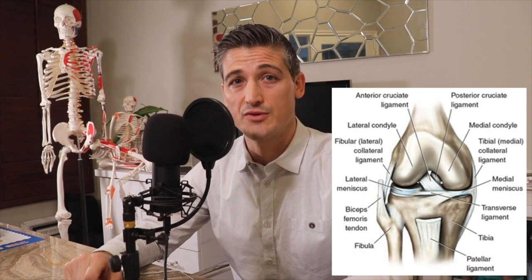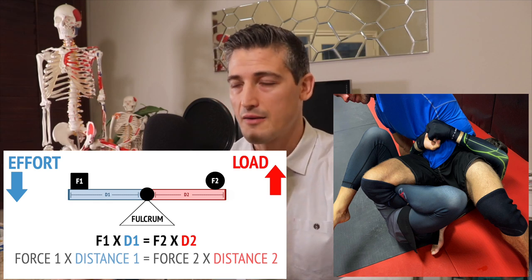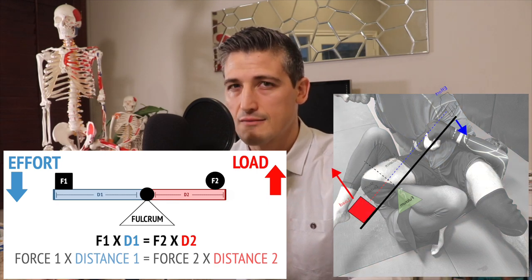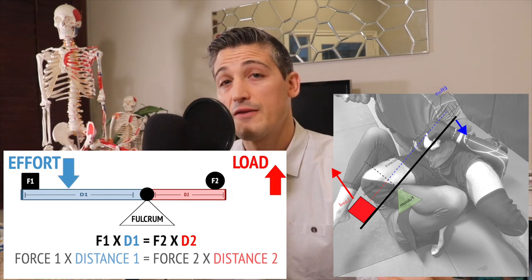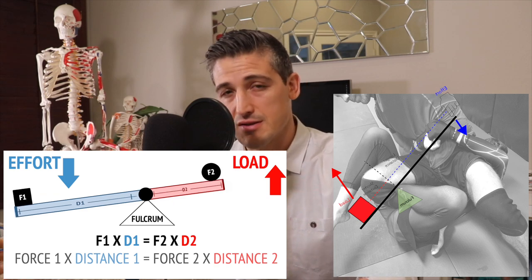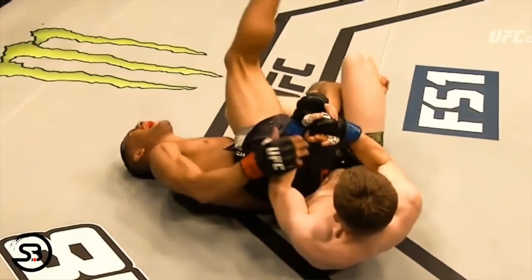There are a few ways you can make the lever more powerful. Keeping in mind the basic formula: force times distance on one side equals force times distance on the other. If the distance is increased on one side and reduced or kept the same on the other, then the force on the shorter side must go up. This force goes up the more there is a difference in the distance.